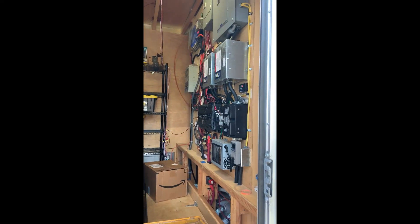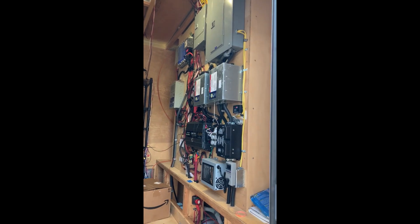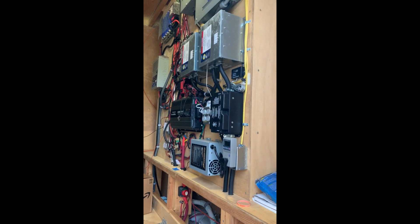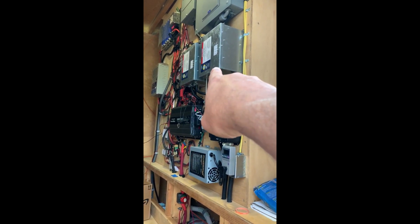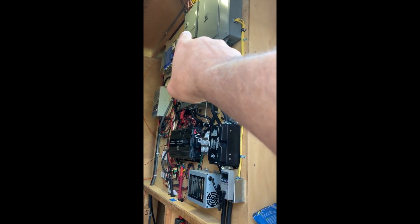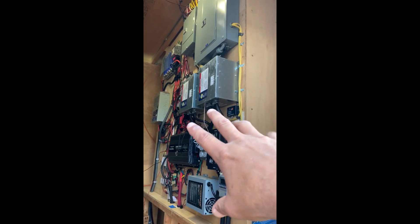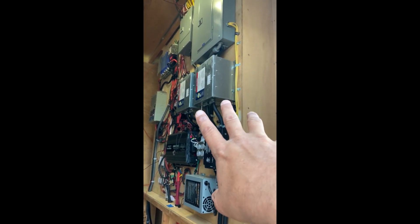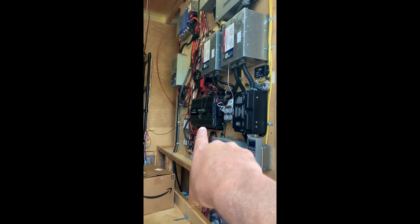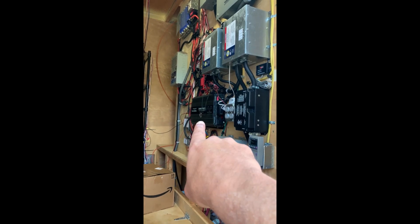Here's my power plant. I got a thousand watts of solar, 1600 watts of potential wind, two automatic transfer switches, my main panel, and what I call my battery sub panel. When I'm off grid or not hooked to utility power, everything comes from my inverter — that's a 3000 watt, 6000 watt peak — then it kicks in.